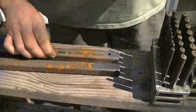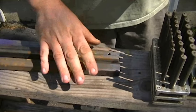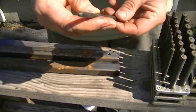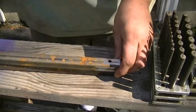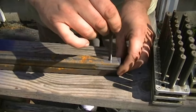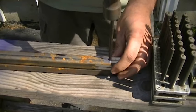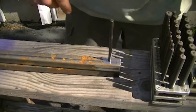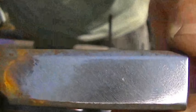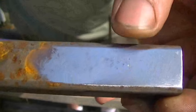I have two pieces of material. Let's say I want to drill a hole in this piece in the exact same spot as I have here, so they line up perfectly — maybe for putting a bolt through it. This is a ¼ inch hole, and this is a ¼ inch transfer punch. The transfer punch uses the existing hole to line itself up and put the center of the punch at the center of where the hole needs to be drilled. I'm going to line these up and just tap it with a hammer. That should be sufficient to transfer the mark to the other piece of material. You can see the little divot. I'll come in with a center punch made of better quality steel and set that mark again, giving me a nice divot for reference.